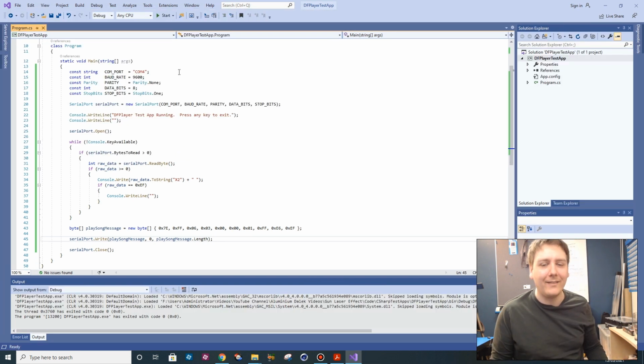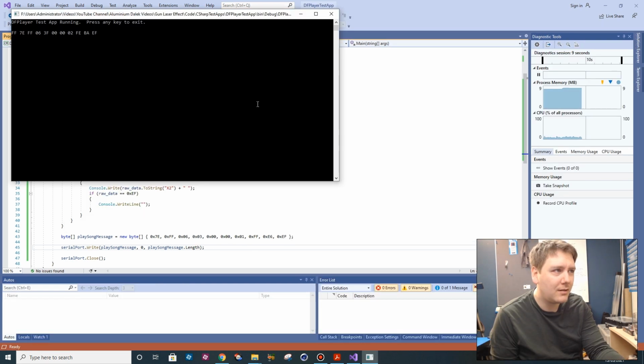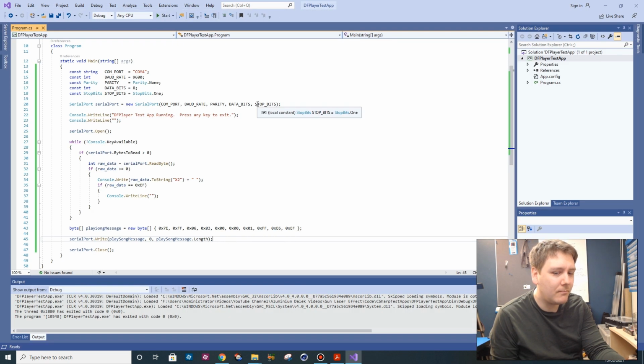No. Never mind. Okay, what happened there then? I might have messed up the file name, so just a quick thing to try. I've renamed the 01.mp3 to 001.mp3, and I've created an 01 folder and copied it into that 01 folder. Nothing. I think I'm going to have to do some debugging. I might have to whip the scope out and see what's going on there.